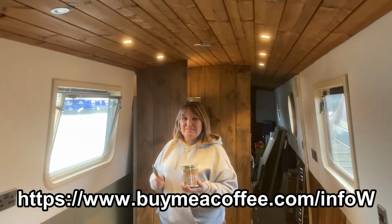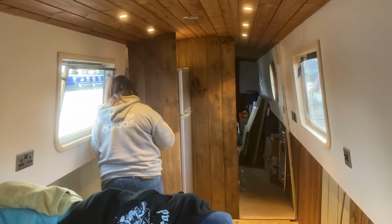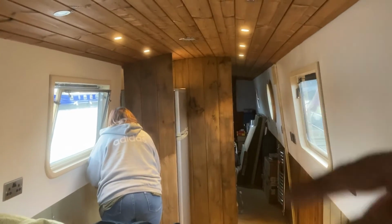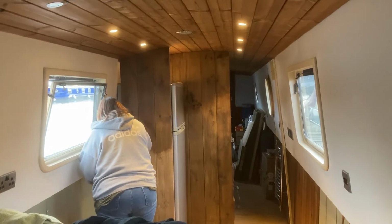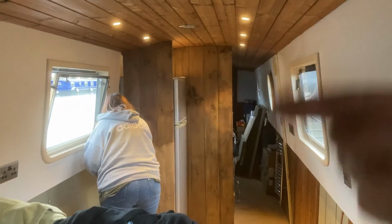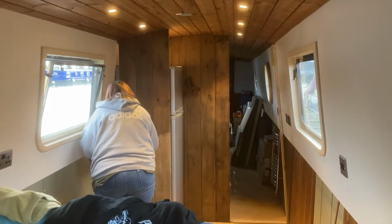So yeah, I'm quite happy with that wall, are you? Yeah, needs a bit more work. I've got to take all those panels back off. It might seem like getting them all in the right place first. What I'll do, I'll take each one off, and then I'll put dowels and glue dowels in each plank, so the wall becomes like one unit.